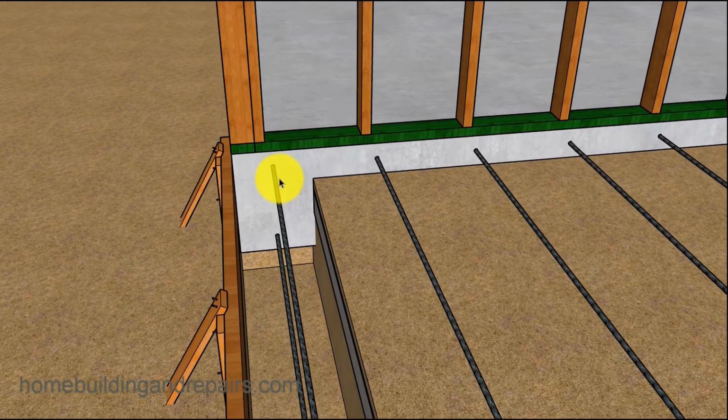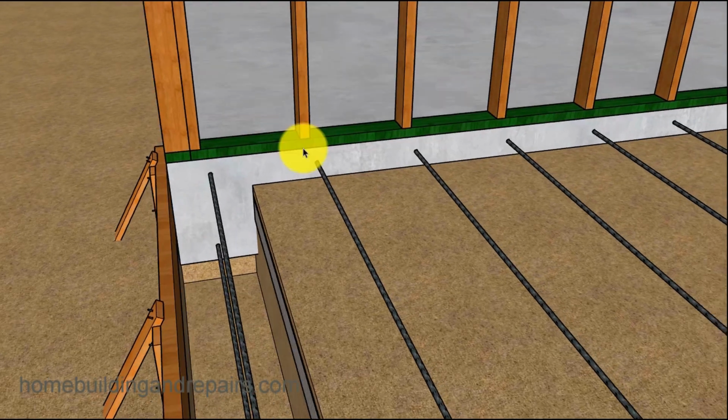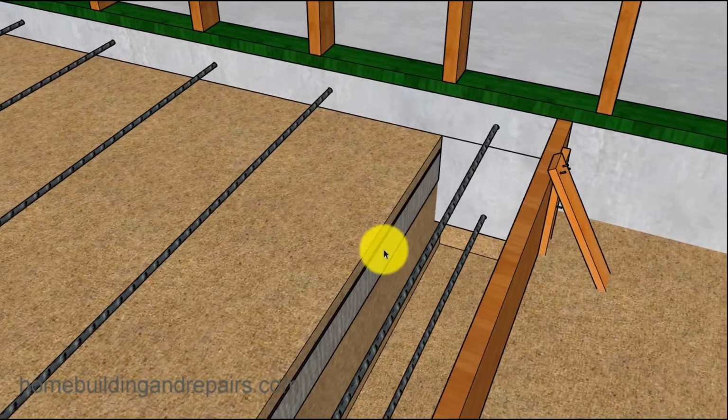And they were going 6 inches in, I believe, the rebar. And don't forget, the hole in the concrete needs to be a little bit larger most of the time. Now, when I first started doing room additions, we didn't have epoxy, or if they did, it wasn't readily available. We used to drill a 1/2 inch hole and then drive the 1/2 inch rebar into it. And of course, the rebar would prevent the slab from rising or sinking.